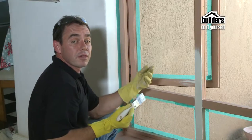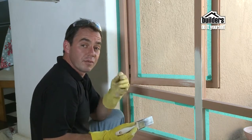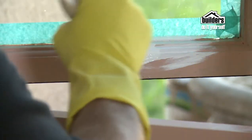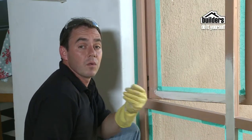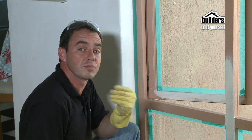You don't have to put on a thick coat — you can always put on a second coat afterwards. Remember, check the can to see what the actual drying time is of each particular product that you're using. Be patient and finish off the entire surface. Once it's dry, then you can give it a light sand down and a second coat, and that should be sufficient.